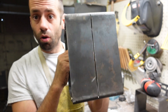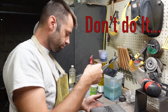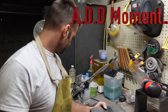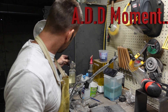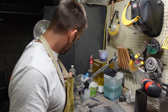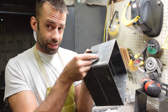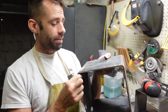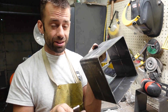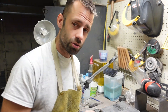I have the sides cut all the way through but I left the corners intact. The reason being I need to weld guide pins to this thing so it will line up when I put it back together. I think it would be better to weld them on while it's all square and perfectly in line, rather than cut it apart and then try to put it back together and line it up. So let's do it now.